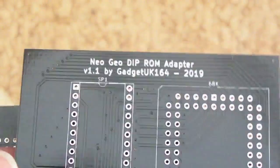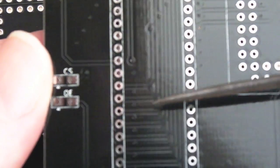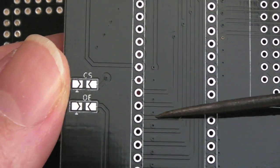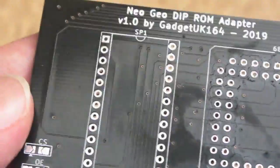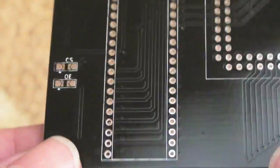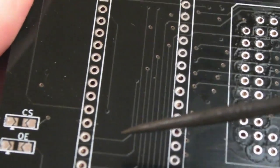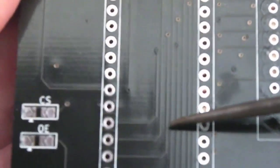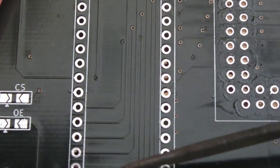So it may be hard to see this. This is the V1.1 board, and let me just see if I can show you. You can see, if we get it in the right light, can you see the ground plane here and the via stitching it through to the other side? And if you look at how this one turned out, bear in mind this was almost identical actually. I did have the ground plane stitches there. In fact, some of the wires are missing, because this is the other strange thing, I did have some stitches in between these, and these had a ground plane.